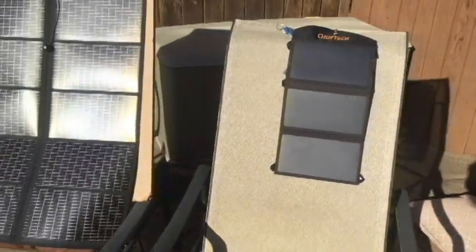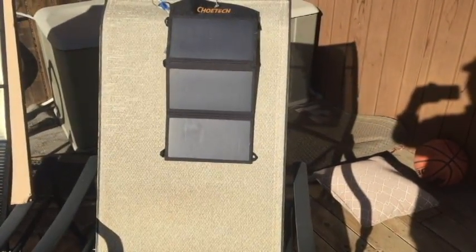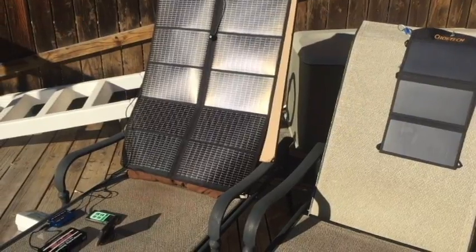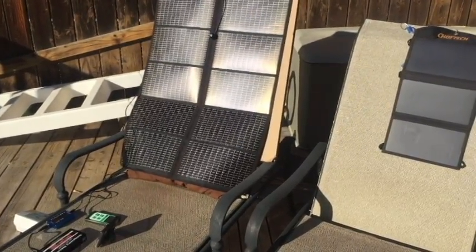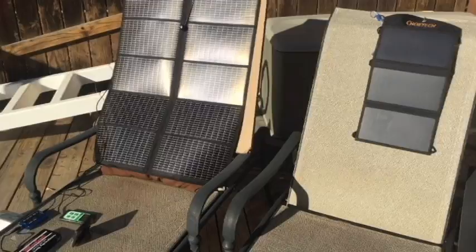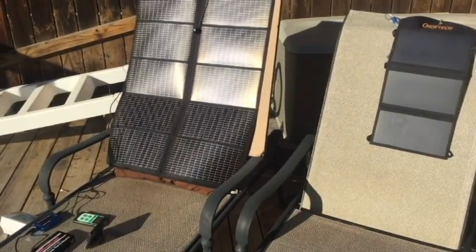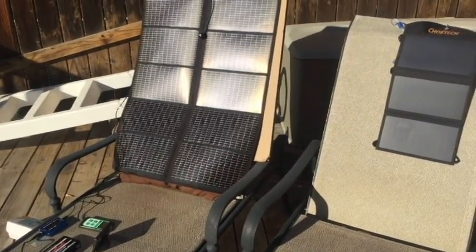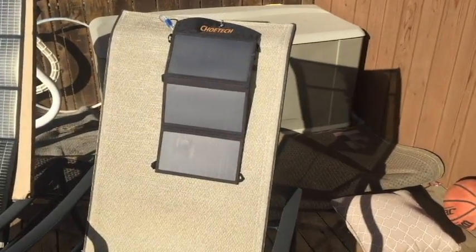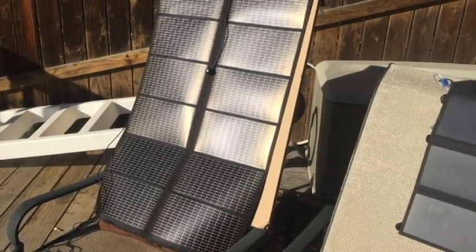They're a little harder and not nearly as flexible, so I'd always opt for this. This weighs about 1.8 pounds, where this is going to weigh about 1.3 pounds. So for half a pound, you get tremendously more wattage output from a PowerFilm panel. It's flexible, so it can roll up. This is military tested — they literally shoot this with bullets, and if you shot it six or eight times, you would only lose about one watt of power. You can see that on PowerFilm's website. If you shot the monocrystalline panel, it wouldn't last very long at all — because it is monocrystalline, it can break and shatter, where this is very flexible. I've put it through a lot and have had no problem. These also bubble up in the sun, where I've had no problem with these bubbling up.